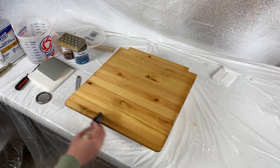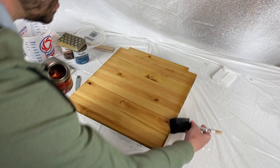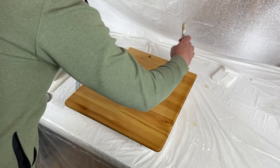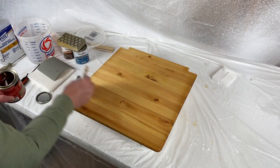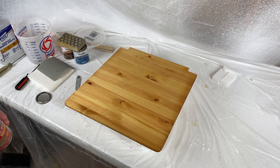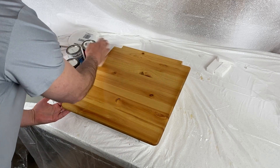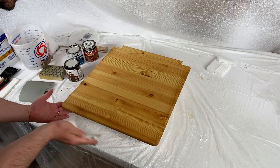Here I'm doing the top of the seat and then around the sides. I'm just going to apply that evenly across the top. Then what we will do is allow this to soak in for about 15 minutes, then we'll come back and apply the stain. After 10 or 15 minutes, I just go through and wipe to clean up any excess that may be standing on the wood.